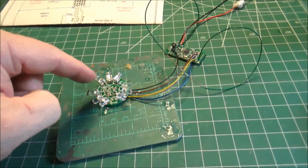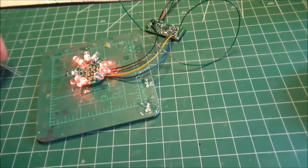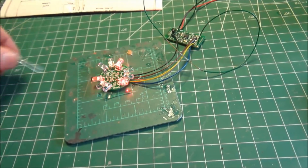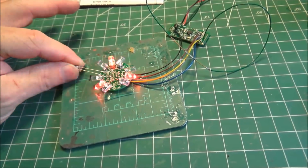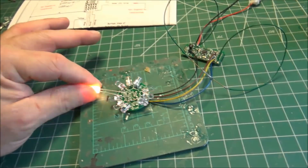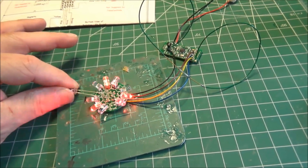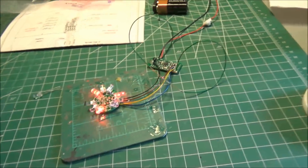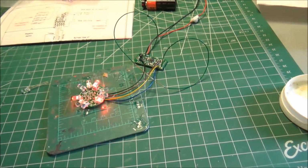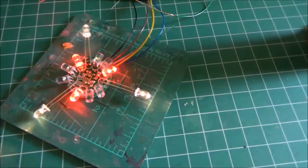And the reason that you see the blank is because I've already chopped out three. It doesn't work. I tried doing a sample with one bulb, and it's the old red-white LED problem. So if I chop out a whole circuit, then I replace it, you can see the white one going off. Then it'll work. Ralph explained it to me, but honestly, it sounded like Greek after a while, but it's about how the red sucks up all the voltage in the room and doesn't allow enough of it to go down the line for the white ones. So it works when I get rid of all of them, but just by getting rid of one of them, it wasn't working.